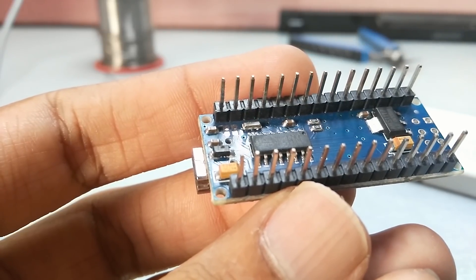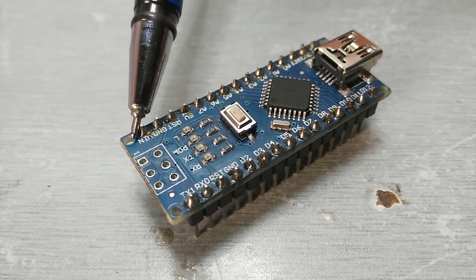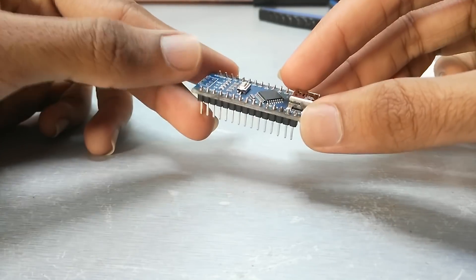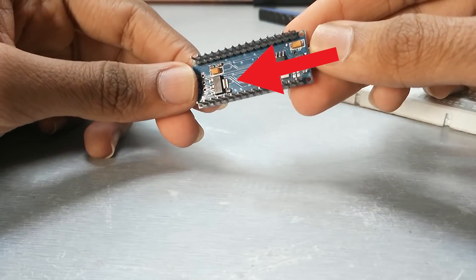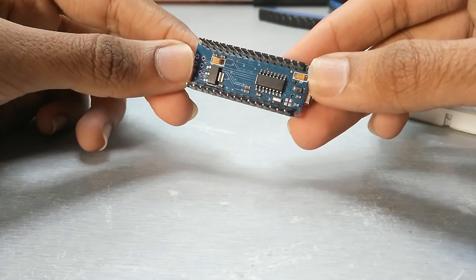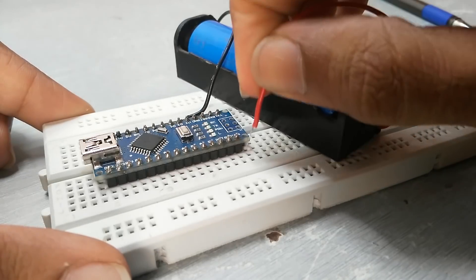Number two: external VIN pin. If you were using the VIN pin when it died, then if you flip it around you will see a small bulged area on the voltage regulator. Replacing this will fix your issue. But in my case, it works via the VIN pin but not the USB.